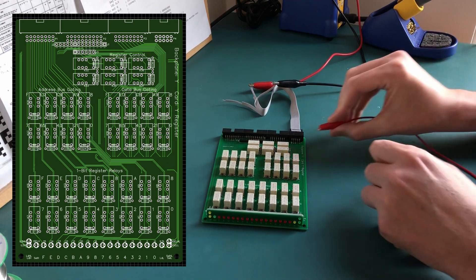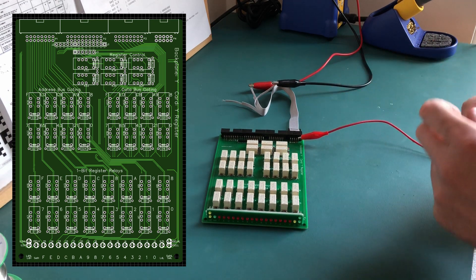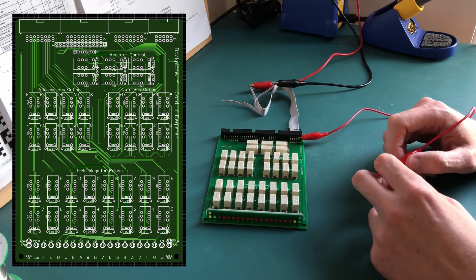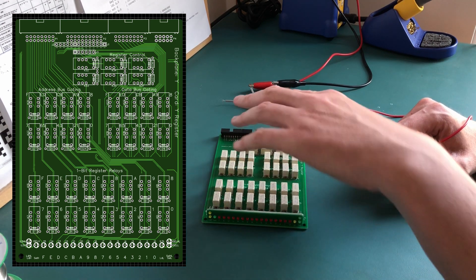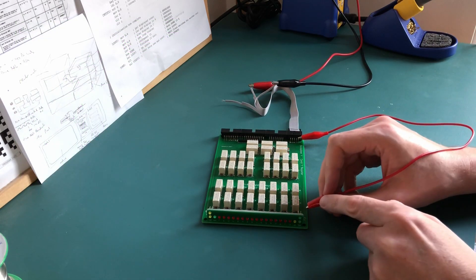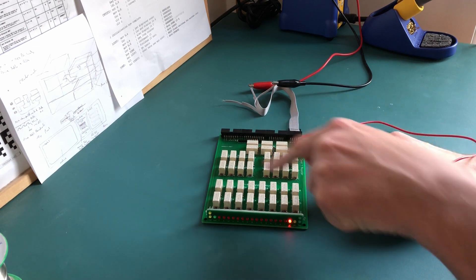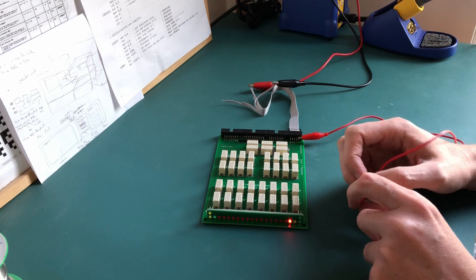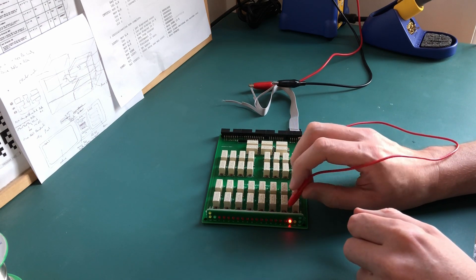I'm going to take advantage of that now to do some testing of the card. If I quickly take a tap off of the positive 12 up here, normally the gating relays here will bring the signal in and cut it off when it's supposed to be holding a value, so it's impossible to load. When you load the card base, it will drop all the values off these relays and load in the new value. What I'm going to do here is take advantage of the fact that by default it holds these values on, so I should be able to bring the LEDs and relays on one at a time.